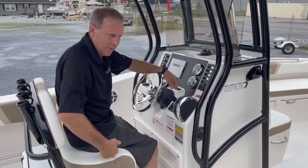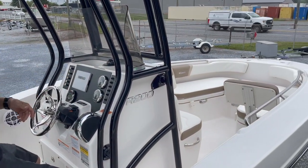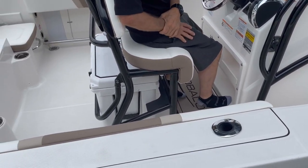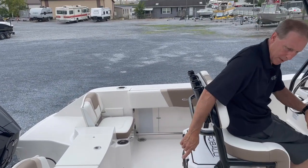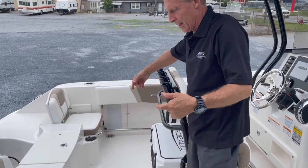This is all hand-laminated fiberglass with Kevlar running from the bow-eye down through the keel for structural support. It is completely foam-filled with flotation, making it unsinkable — and boats beyond 20 feet don't even need that requirement. It is also self-bailing, with big stainless steel cockpit drains that let water go overboard rather than into the bilge.